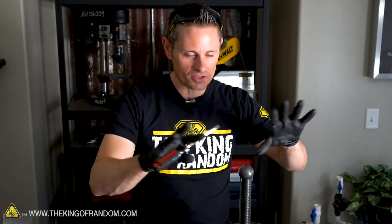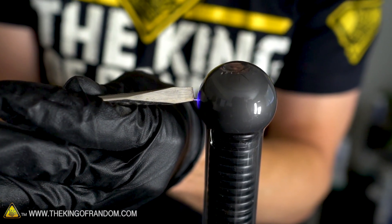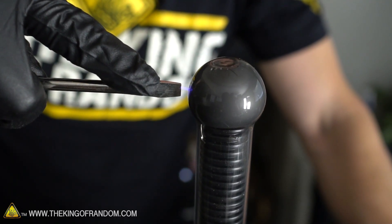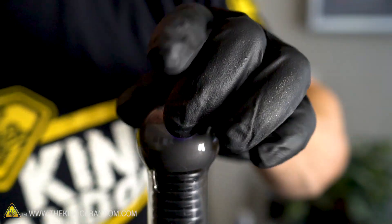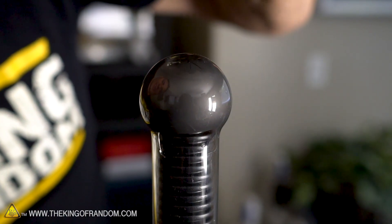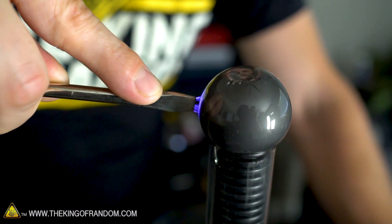The dome is gone, you don't see any more arcs flailing around, I don't feel any charge in the atmosphere. But if I touch it, you can actually hear it buzzing and hissing. If I take the tip of a screwdriver and touch it, you can see little arcs start flying — though they're not nearly as dramatic as the long octopus arms that were inside the dome. I think there's only a couple thousand volts there. Because we're in standard atmosphere now with nitrogen and oxygen, it just doesn't have the same effect. You can also see a purple glow around my fingers, though it gets really hot fast. The crazy thing is you can see arcs flying into the screwdriver tip with my fingers right beside it, but I feel absolutely nothing.